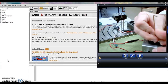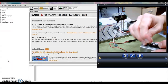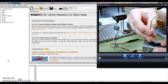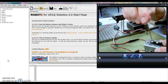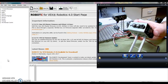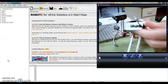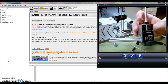So here's one. I attach the other motor screw in the other hole, and then I just have to put an axle in. The motor is now firmly attached inside the U-shaped bracket. I take an axle and slide it through the other opening in the bearing, and that fits into the opening of the motor.